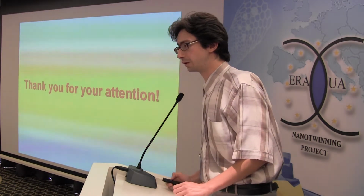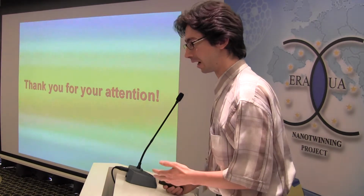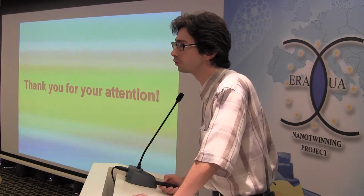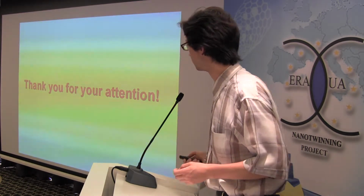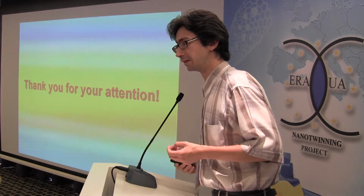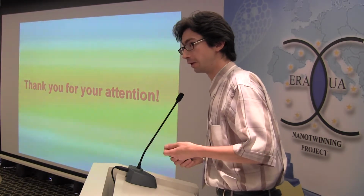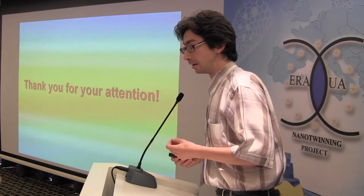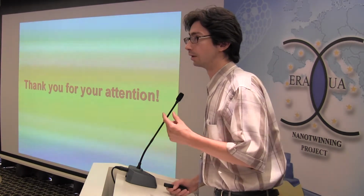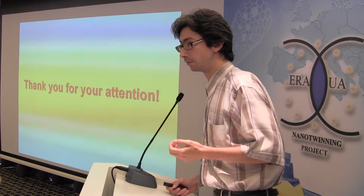Yes, it's a good question, but unfortunately we haven't done any peel test yet. I know it's very important, and it could be a bit difficult to make a peel test on multi-layer monomolecular films, metallized. If you make a peel test, you can peel not only the metal coating but also the polymer film, which is rather thin. The thickness of one monolayer is about 1 or 1.5 nanometers.